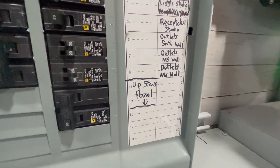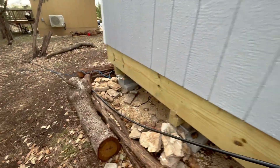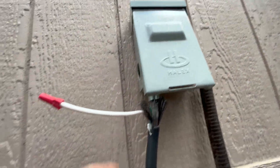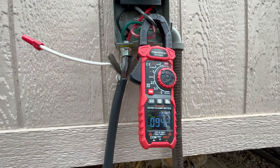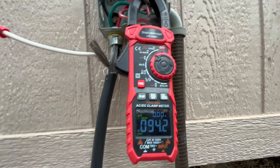I ran the cord to the outside of this building and all the way over to my four-ton air conditioner about 80 feet away. The SO cord is wired right here — I just needed the two hot legs and the ground, no neutral. Let's go ahead and fire it up. AC is running — 94 amps is what I'm seeing. So this FlexBoss 21 inverter can obviously handle easily my four-ton traditional air conditioner, and it should be able to start a five-ton air conditioner without a soft start, without an issue.